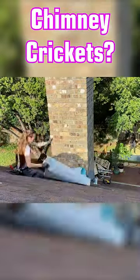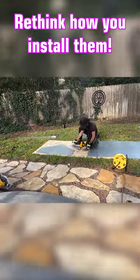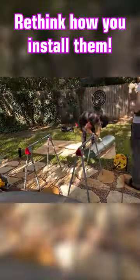the cricket is designed to divert the water around the outsides of the chimney so that it can flow freely and run off the roof like it should. A lot of roofers just reuse the flashing that you already have, but we have found that that leads to so many leaks.